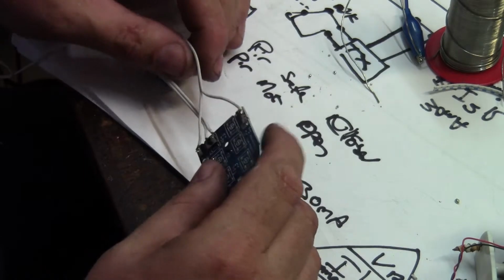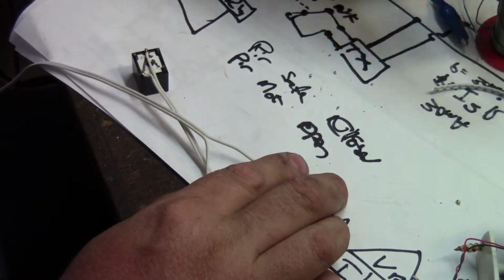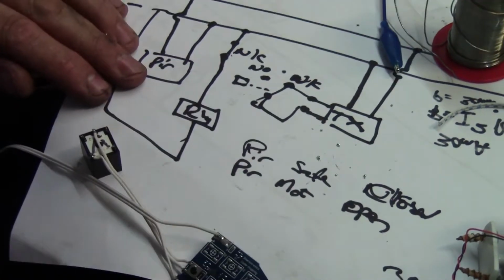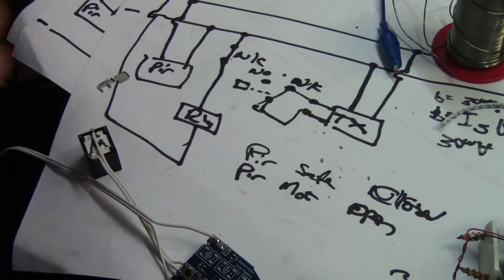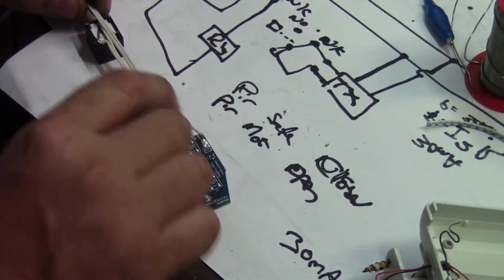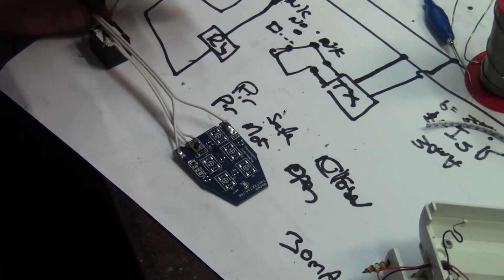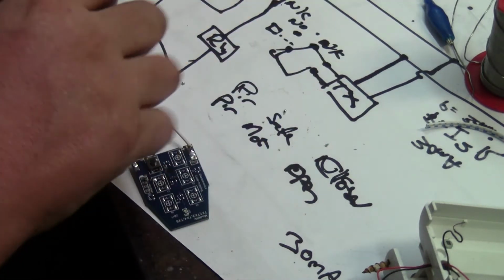So that's fine. We've got our positive with our dots, our negative with our stripes. Okay, and we said that our relay is going to be joined. Oh, okay, my diagram's a bit screwy here. Thanks for telling me, guys. If I find my pen, the relay is supposed to be joining up to the positive because we are switching the negative. So what we are going to do, we're going to take the relay and join up to the positive with the transmitter's positive. There's a coil, so we're just going to tap it over there.